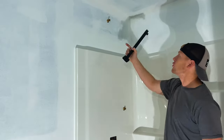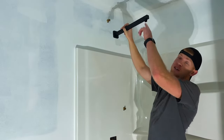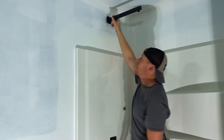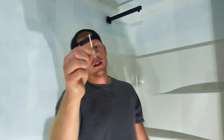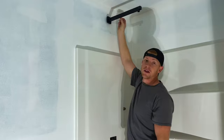First up: install the shower arm, making sure it's coming out of the wall level. It's a pressure fit — three O-rings on it, just slide it over with the opening down. Then it comes with a hex key, but it's kind of tough to get to since it's on the top and you can't spin it because you'll hit the wall.